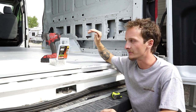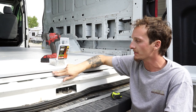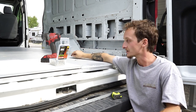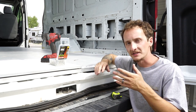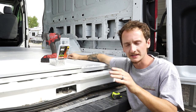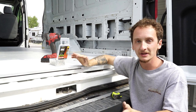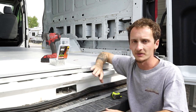We got all the holes drilled and it's looking really good — except for the two back ones. On one piece there's about an eighth-inch gap between the wood and the aluminum. On the other piece screwing it down closed the gap fine, but it caused the front piece of wood to lift up — and there's no aluminum under that front wood to screw into. Two solutions: add another piece of aluminum, which would mean scooping out foam board that already has adhesive down; or add a small quarter-inch piece of wood running the length of that area so we can screw into it without the front lifting. We're going with the easier solution.